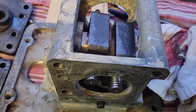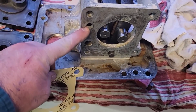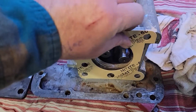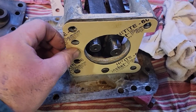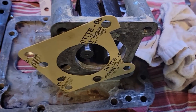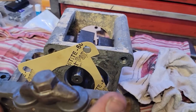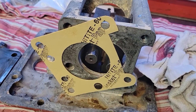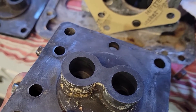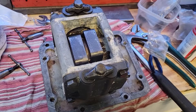You put the pistons in at an angle down and then turn them sideways and slide them into place. Once those are in, you're left with something just like that. Next, get your gaskets that go on the sides - make sure you notice where the holes are and match your gasket up the same way. Then pick the valve section that matches that, and put in the four bolts, making sure everything lines up and working the pistons into those holes. I've been putting a little bit of lubricant on all the moving parts so when it first fires up, everything's lubricated.